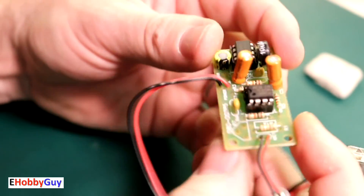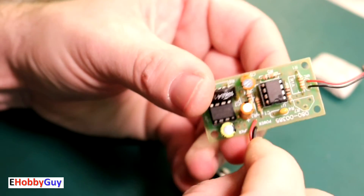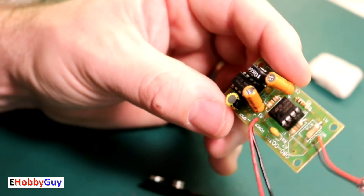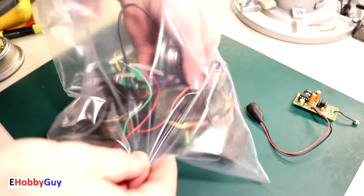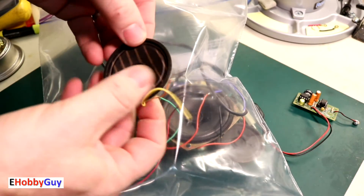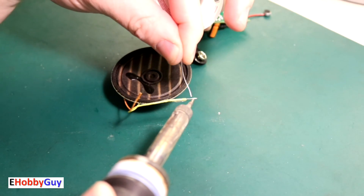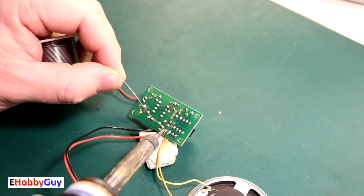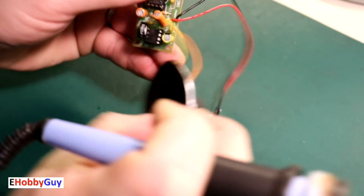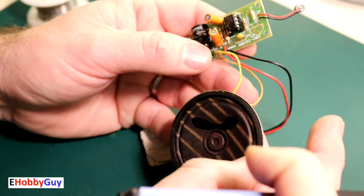I realized there's no oscillator and no inductor — this isn't transmitting anything, so we need to hardwire a speaker. It could be a set of headphones. I'll look through my scavenged speakers to find one that works. This speaker wasn't included with the kit, so if you're thinking of building this you'll need a speaker of your own or a pair of headphones. I'll tin the wires before connecting them to the board to make it easier.